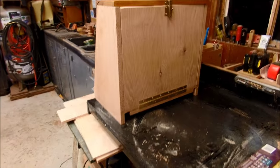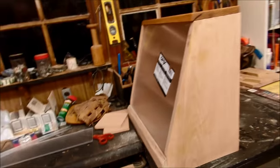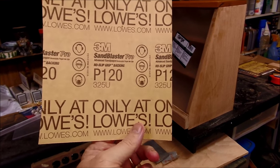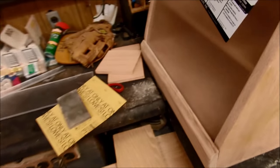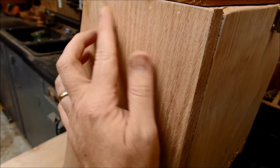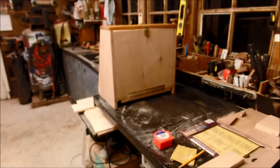I need to get sanding. I sanded everything down with 120-grit. I really like this sandpaper — it's called Sandblast Pro, says only at Lowe's, but I'm sure others sell something similar. It's really flexible and works great on a soft block, gets around corners nicely. Everything's down to 120 now so we'll go to 220, get out a few scratches, and make it really smooth.